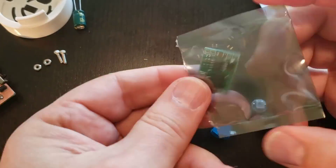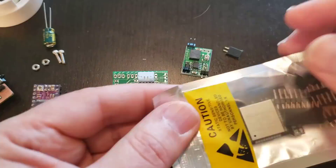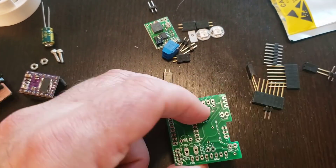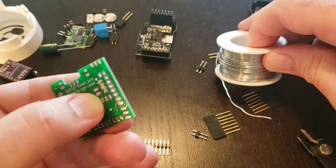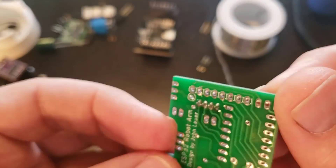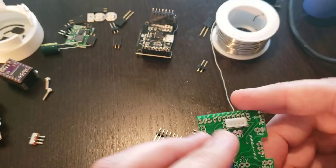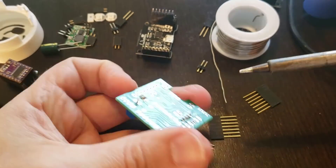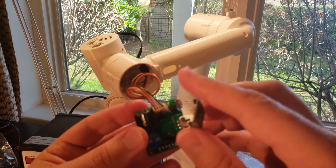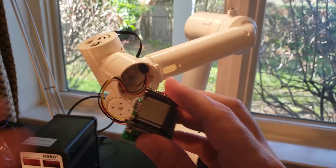Here I've got the final boards in the mail, so I'm assembling it for the first time. You can see I'm doing the DC-to-DC converter — I've got the correct jack for the microstepper motor. I got a whole bunch of different components for the headers and soldered the board up. It's about a five to ten minute soldering process to get all the components on there. I use lots of flux to make the soldering go well. Here's the final assembled board — it's got a big capacitor for the stepper motor, the wire connects nicely, and the ESP32 goes in.